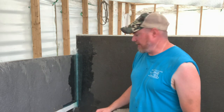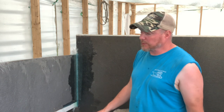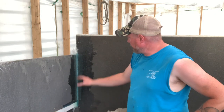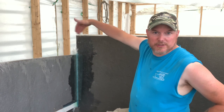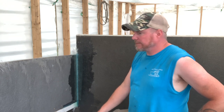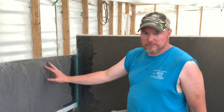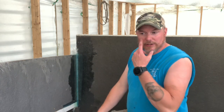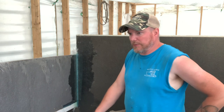So you kind of get the gist of what I'm doing here. This corner I'll let tack up for the week, because with the laminating resin we can come back at any time and go right back over it. I'm pretty happy with how this came up — that should hold this pretty tight. I'll round the opposite side and hit that, wrap that around. Because this is getting two or three layers of chop strand, and then the other side is going to get a layer of 1708 and a layer of chop. That should keep this pretty well stiff and tight.